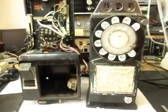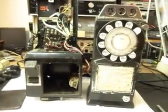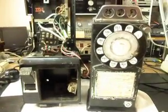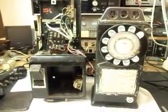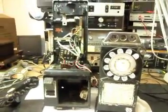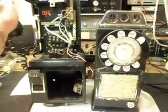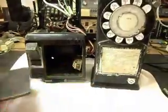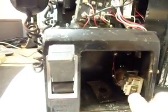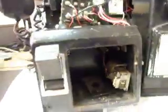It's a similar lock to what we would put in the vault door and we can use a similar lock over here in the body as well. Basically what that does is save a lot of money. If you don't go totally original with it, it shouldn't be a big factor because you'll have your locks. It's not going to be out in a payphone public situation any longer, and a lot of customers opt for that — keeps the cost down and you still have the look, and the unit will still lock. The body will lock to the base of the telephone, and so will the vault plate, this little vault door. Right now what they have to hold that into place is a screw — we'll lose that screw. And this screw over here that they drilled through the side to mount the bell will go away also.